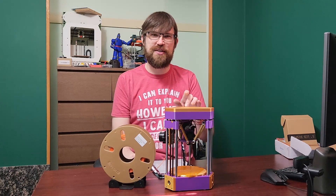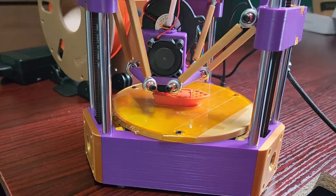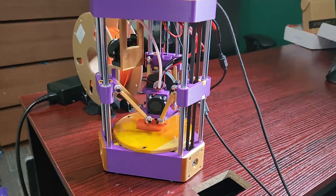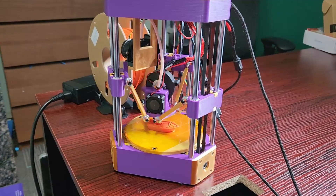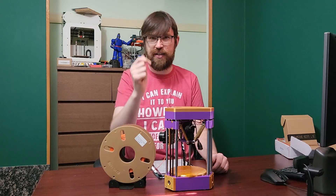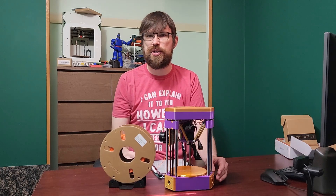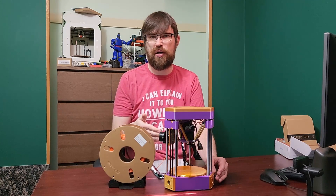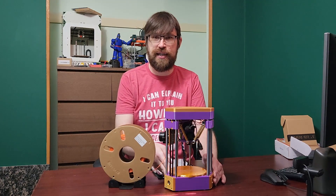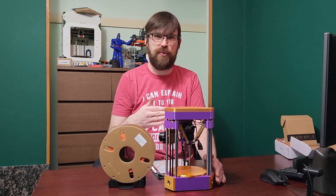This is 70 millimeters build area by 95-ish millimeters tall of printable space. This is a very small printer, and I think that's maybe why it's so cool. It's under $300 US to build this printer depending on what parts you have. If you already have motors — it uses just standard NEMA 17 motors — and some linear rods laying around, the price can be significantly cheaper.